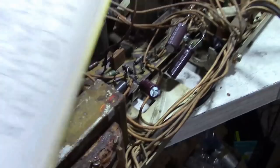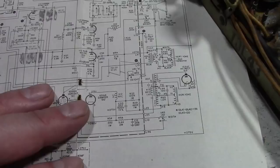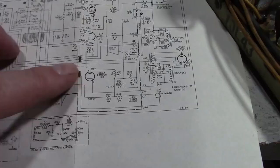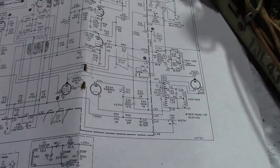Now you've got to be careful, because there are some voltages present on some of these points that will destroy or severely damage modern test equipment. They even tell you on some of these points: do not measure. 700 volts peak to peak - I'd be a little wary of putting a scope on that. Likewise, you don't want to put a meter or a scope on the cap of a horizontal output tube, and likewise some of these points in the vertical circuit, unless you have equipment specifically designed to handle high voltage pulses like that.